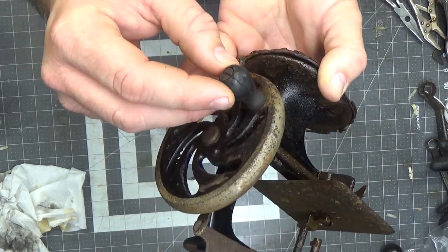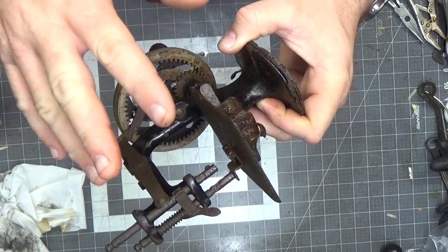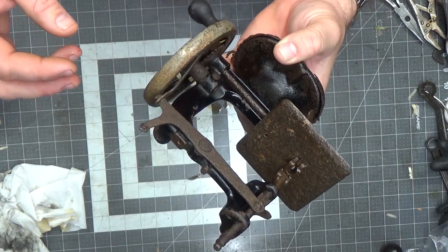I might try to take this wooden handle off because I don't want to sandblast it. But take off the little bit that I can take off now. Get rid of the oil and residual stuff on here with the brake parts cleaner. Get it nice and dry and then bring it over to the media blaster. So I'm going to do that now.